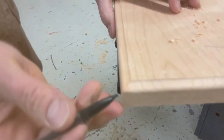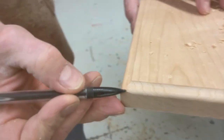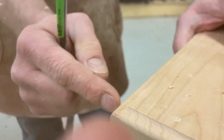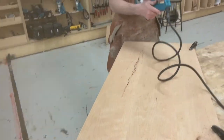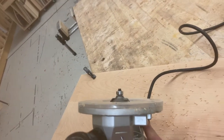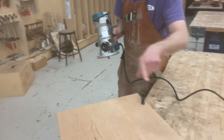I'm going to show you this corner I missed. It came around and the bearing came off and then went back down. Look how it left a sharp edge — it's not rounded completely. So I had to come back and redo that. Now it's the second pass. I'm going to lower the bit about an eighth of an inch — this isn't my final pass yet. I'll take these three edges, then flip it.